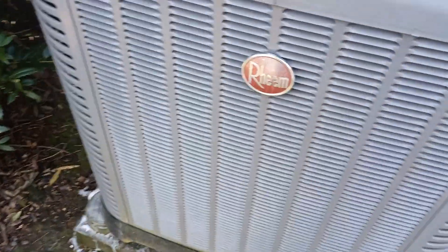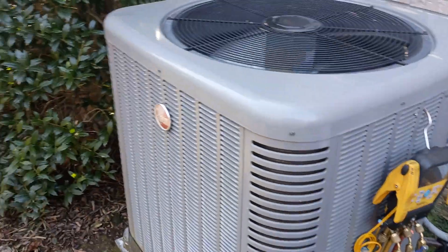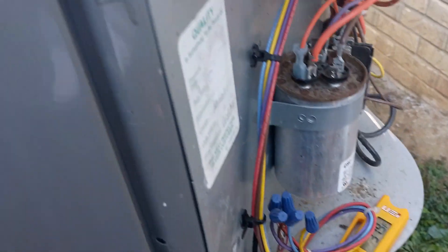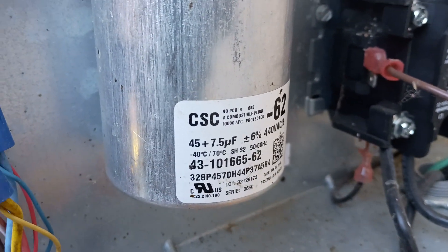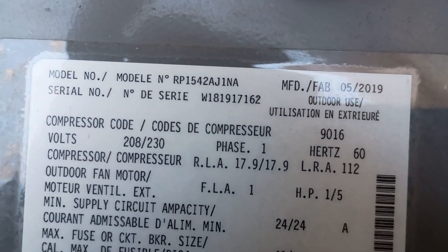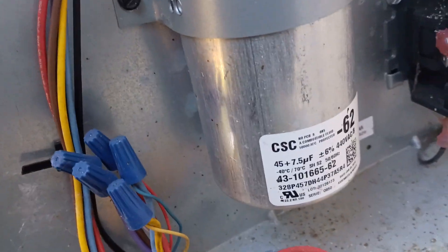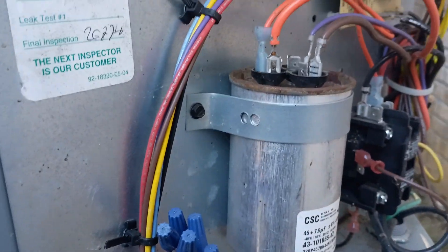That's just one of the things to keep in mind when working on these new Rheem units. They're very nice looking units. Once they got some of those bugs worked out - the copper cracking, reversing valves leaking around the joints - they seem to be doing quite a bit better. This one's got a little funky sized capacitor on it: the 45 plus 7.5. You can see we're working on the three and a half ton 2019 model. Of course you've got to have an oddball capacitor like that, the way they used to have those three microfarad fan caps back in the day.